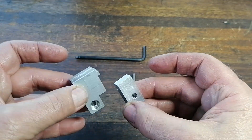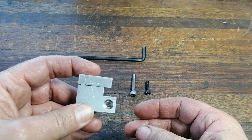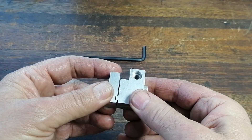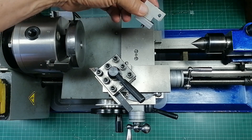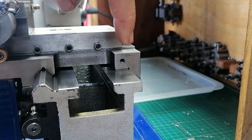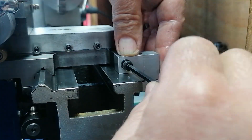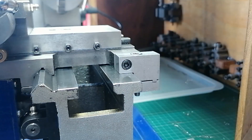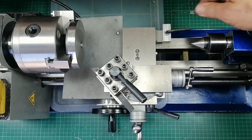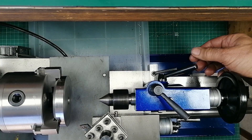Here's what I built. I made it from aluminium, so it's softer than the bed — no chance of damaging the ways. The top part of the lock slides onto the bedway, and the bottom piece clamps underneath. I drilled and tapped a hole in the side of the saddle, and the lock bolts right in with an allen bolt. To make it easy, I even cut an allen key short so it lives in the lock permanently. It doesn't get in the way of the tailstock levers, and now I never have to hunt for a wrench.